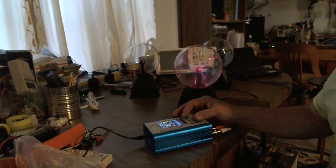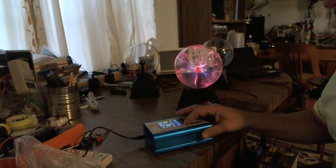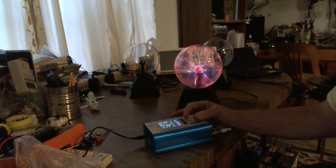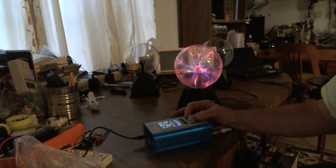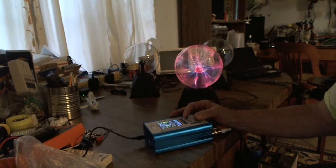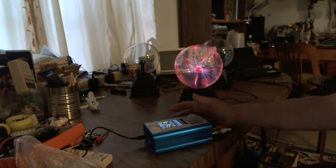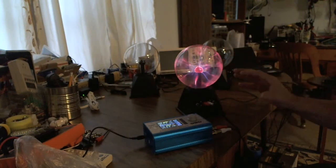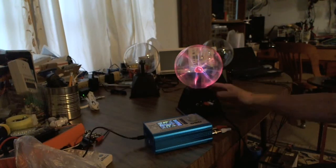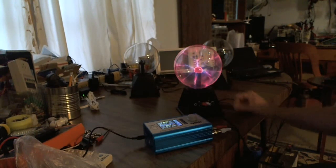I am going to go back up to 10 kHz for a nice looking plasma, and I am going to play around with the duty cycle. Trying 40% — you can hardly tell the difference. 30% duty cycle, can't really tell the difference. 20% duty cycle, slight difference. Right now I am at a 10% duty cycle. If you can remember the 3-inch plasma ball, this 6-inch is far more dynamic — just way beyond my expectations. It runs off of 12 volts rather than 5 volts, and that is a significant part of why it works so beautifully. It's just unbelievable.